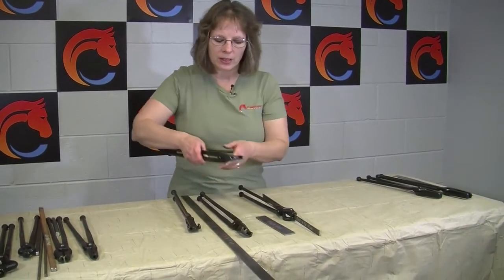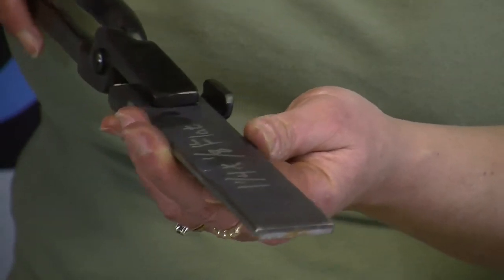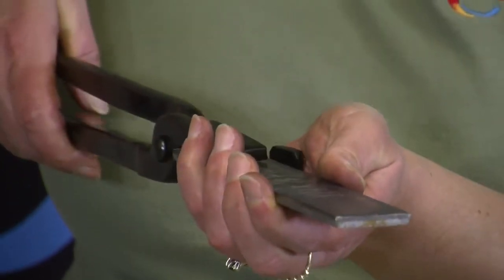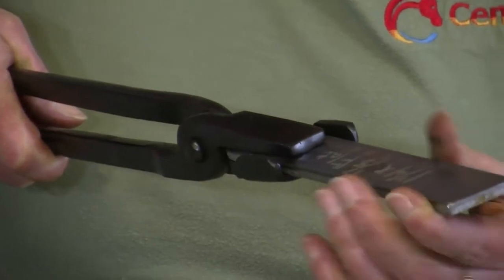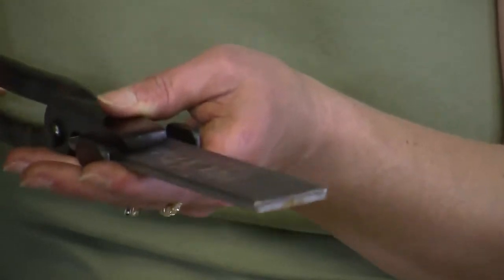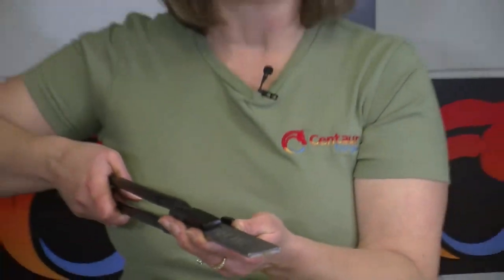Moving on — these are an inch and a half wide, and this is a smaller piece, an inch and a quarter flat bar stock. It wiggles from side to side. I can use this; it's not going to be a perfect fit, but I can use it as long as I have a good firm grip on the tong. You will still have movement from side to side, but you can use it as long as you feel good and safe holding this piece of metal, especially when it's hot. You can go smaller but not bigger, and it's going to make a difference in how well it holds your piece of steel.